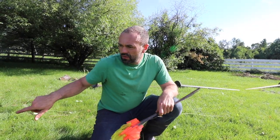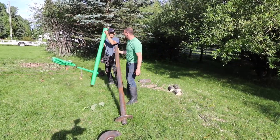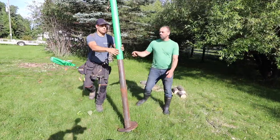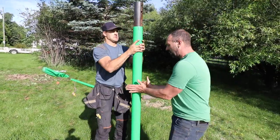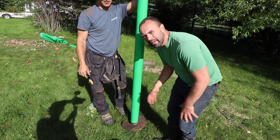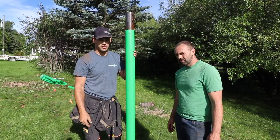We've just run all of our strings and checked for square by measuring diagonal. We're out by a sixteenth of an inch, which is unbelievable. One of the things that makes these guys unique is these plastic sleeves - it's one of their differentiating features. This sleeve moves independently of the pile so if there's any kind of ground or frost heave, the frost heave will bear on the plastic and not on the pile, making the foundation more secure. The frost will grab the sleeve and slide it up and down instead of pulling on your post - that's how they can guarantee all their work.